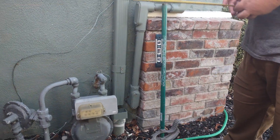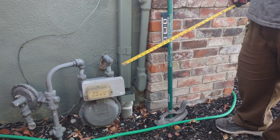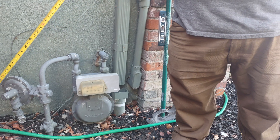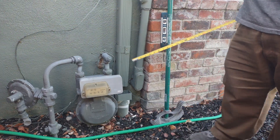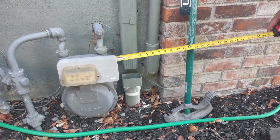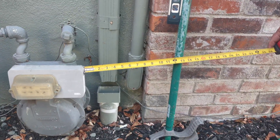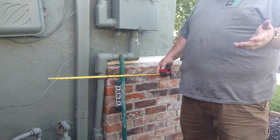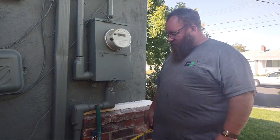I have to be 12 inches away from either side — the outside edge on this side or either direction. So I measure here, and as you can see we are really, really close on this one — just barely over 12 inches. Now we're good — we're through the first hurdle. It has to be at least 12 inches away, so if it was directly underneath, no go.